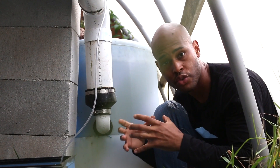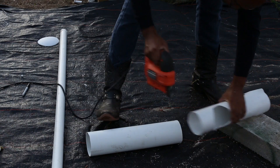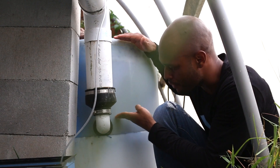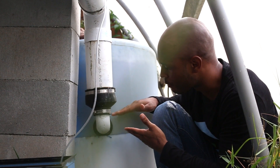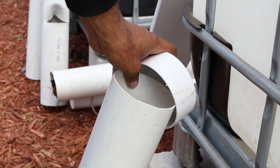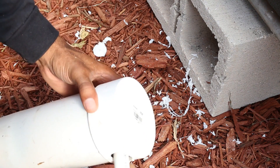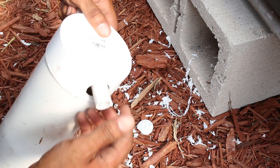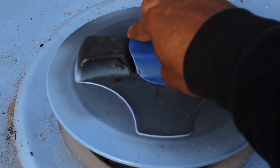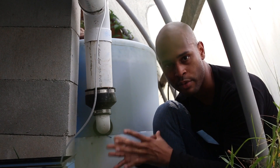To keep all the solids concentrated, the standpipe uses a 4-inch diameter sewer and drain pipe. The length of it reaches towards the top, a little bit above where the top of the inserted pipe is, because we don't want it resting on the pipe. The 4-inch pipe has a cap on top, and I drill inch-and-a-quarter holes on both sides, then place a PVC pipe in there that runs the length of the center area where the main cap is on this tank. This holds the standpipe steady and acts as a barrier so solids won't exit out and will concentrate where we want them.